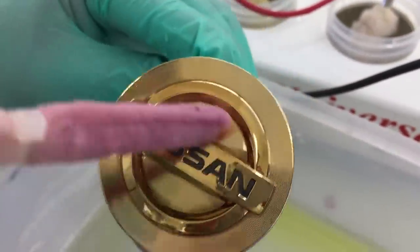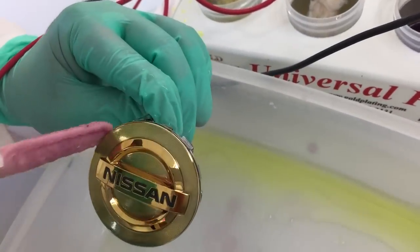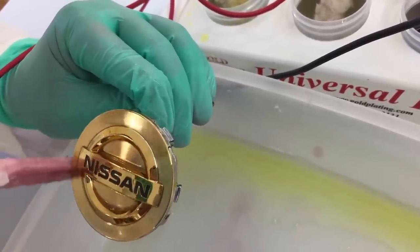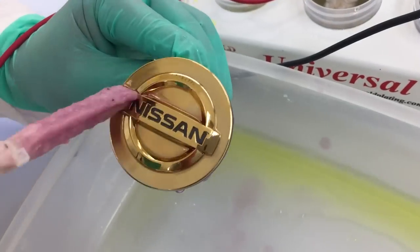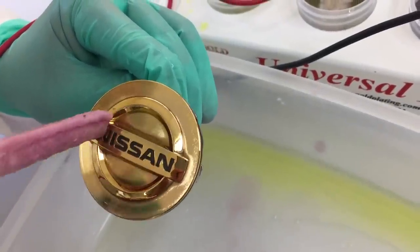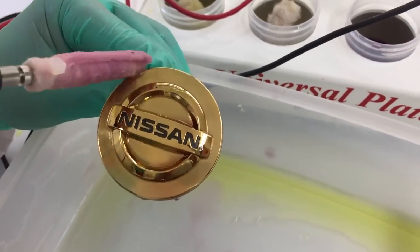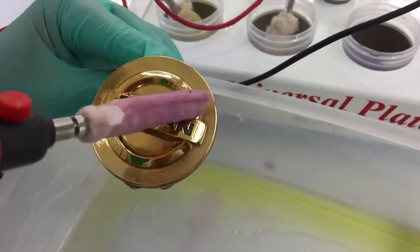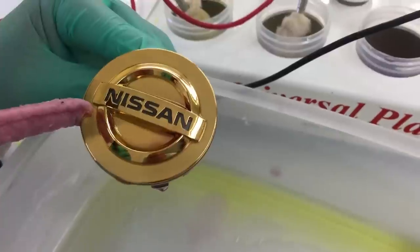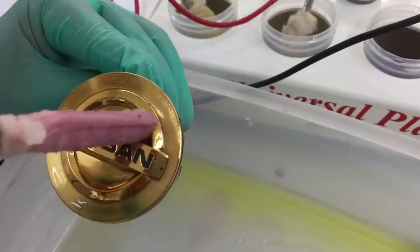As you can see, it's turning gold quickly — that looks very nice. You want to spend probably 1 to 2 minutes in a given area. Dip frequently and make sure you get everywhere. This is actually a rapidly applying gold solution that we make, and it goes on pretty quickly. In this 1 to 2 minute time, you are really applying a fairly thick layer of gold in the electroplating industry. It will last a long time if these are taken good care of. And it's already done — you could call it good right there. It's a very, very nice plate on it.